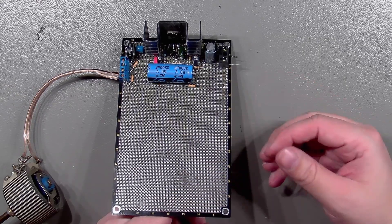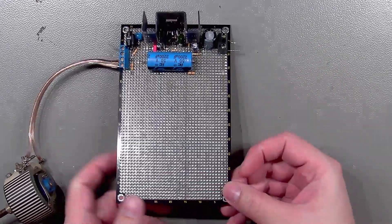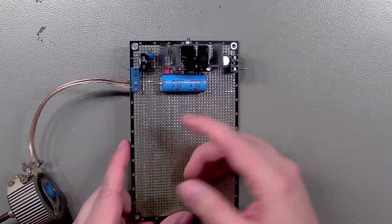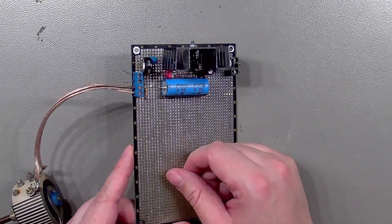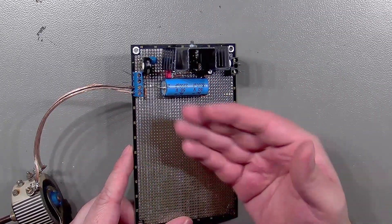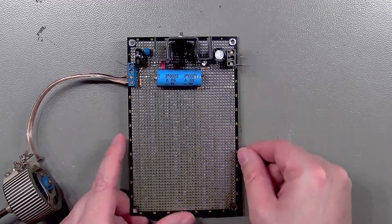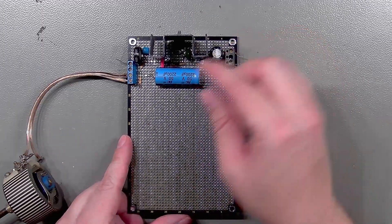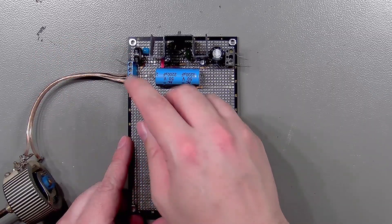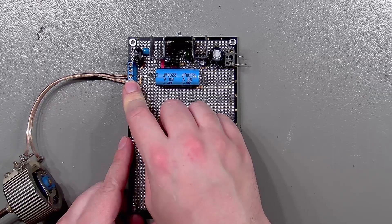And here we are with the finished product. It's just a quick and dirty kind of deal. I also added a few more things, like a trim potentiometer here for basic volume control. I added terminal blocks for the power input, line signal input — or in this case the signal generator — and load output, where we will connect our output transformer to.